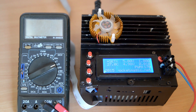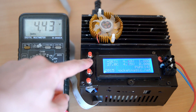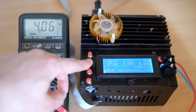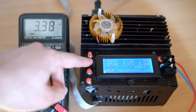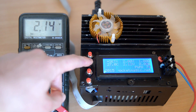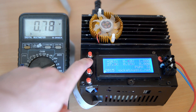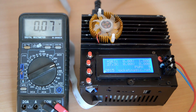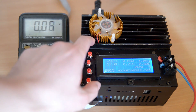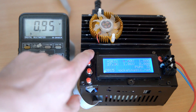The bottom level of 0 volts can be reached with no issues. I am using one of the two buttons controlling the voltage to go down to 0 volts. On the multimeter connected to this supply, you will see a parallel measurement of the output voltage. There we are. And let's get back to one volt.